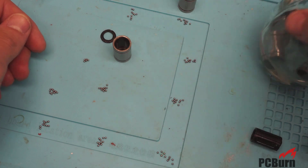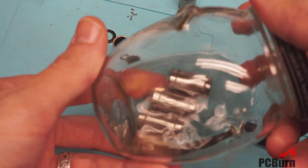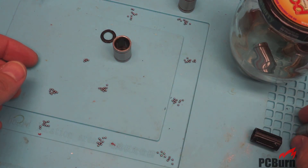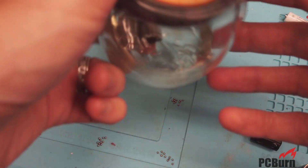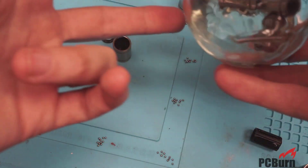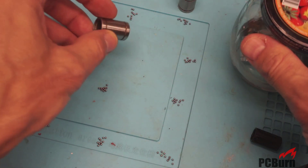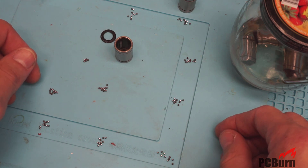In the meantime, I'm going to be cleaning out these. I'll let this sit for a little bit and come back probably half an hour later after shaking it a little bit and see how those are doing. Again, that's 91% alcohol — just letting it be a solvent in there and clean up any of the shipping gunk. Then I'll press fit some grease with a rod into the bearings, and that'll hopefully make them run a little smoother on the Prusa.